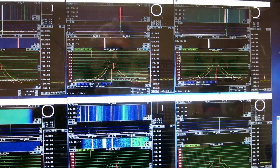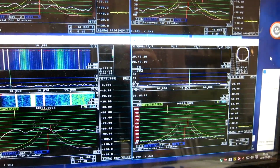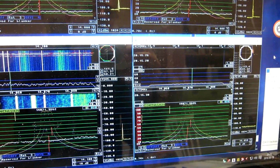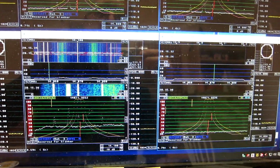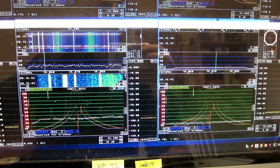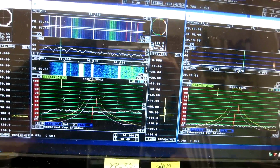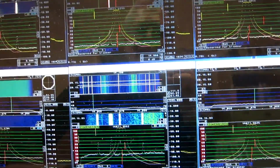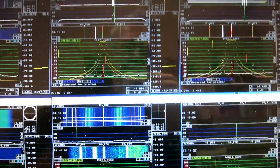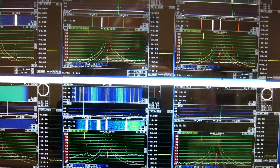I'm now stepping in steps of 1 dB, looking at the S-meter graphs. Now the second order is -100 dBm on all 3. And now it's 95 or 96 or something. And about -90 dBm here. It looks a little bit scary to have the same result on 3 different radios. Maybe this is a limitation of the setup. I have to investigate that.